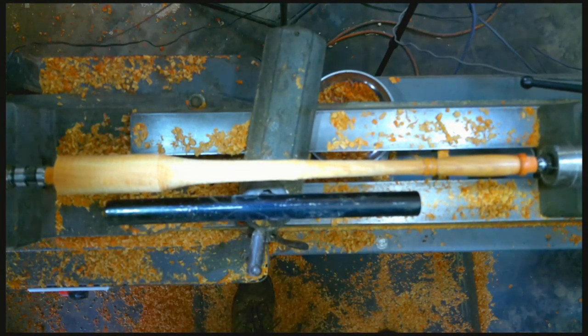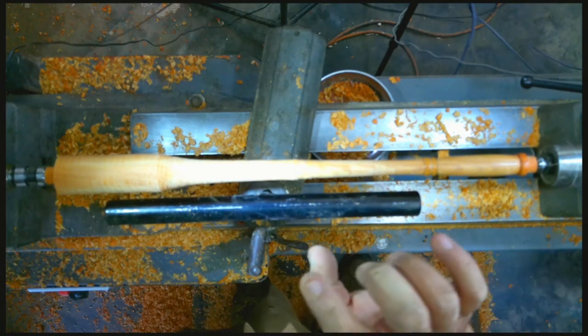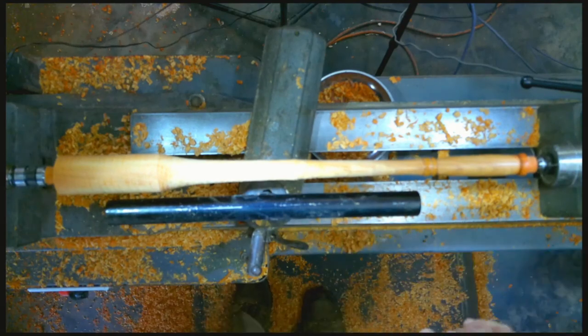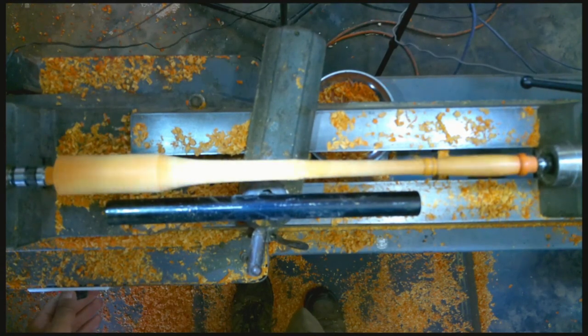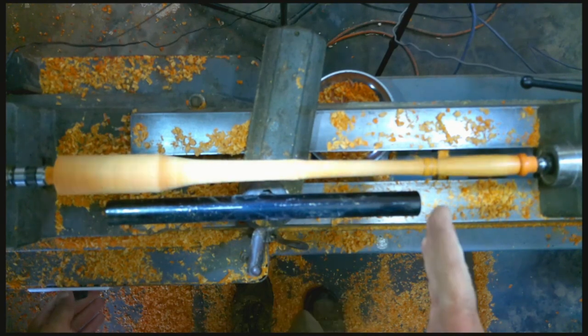The outermost pulley, the narrow one on the top, was dented or warped. And so that was creating a lot of our shimmy and a lot of our shake. But if you look and hear, that's gone. It's a lot more steady, more stable. I just moved the belt over one.